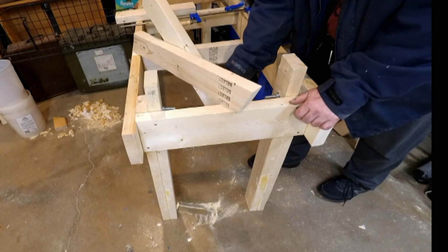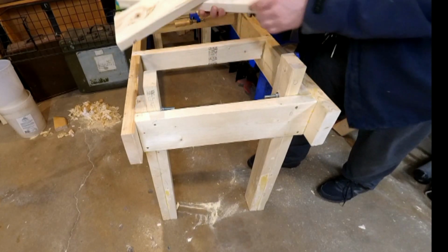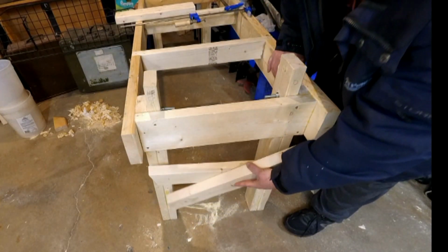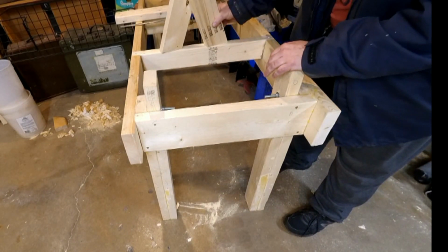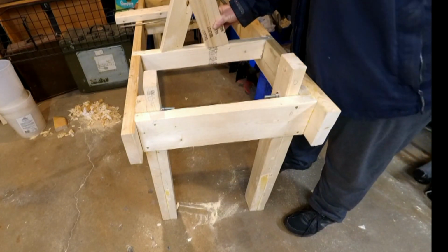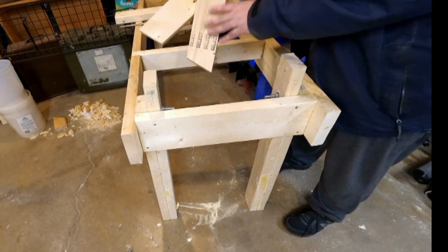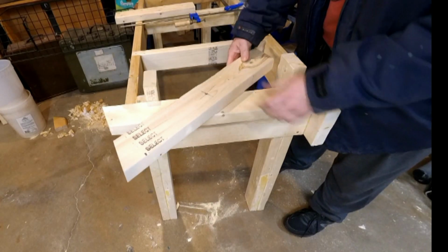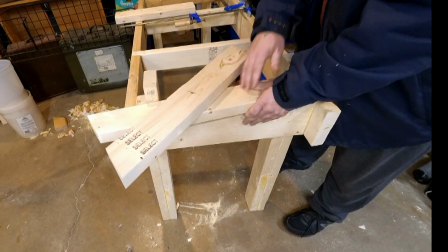And so I've set this up in the right sort of position. And we've got traced lines in here on both sides where it has to be carved out. I want these ends to be roughly parallel, kind of like that, because they'll match up against the parallel of the legs, right? Makes sense in my head. And should be good because this is a select piece of building lumber. So we're going to knock these back apart, bolt it down to the bench here with some clamp action, and I'll get to the next step for you.